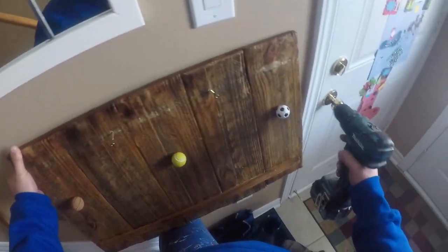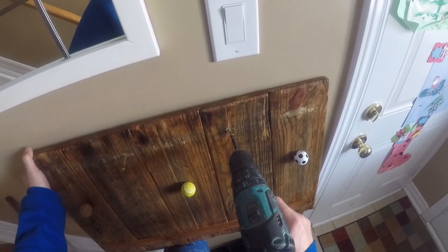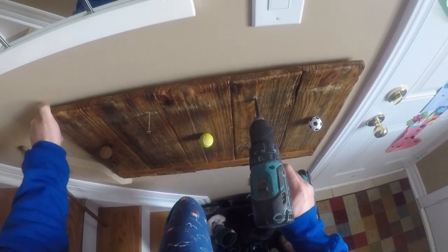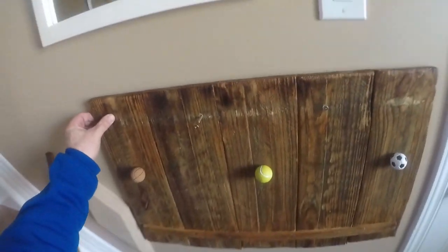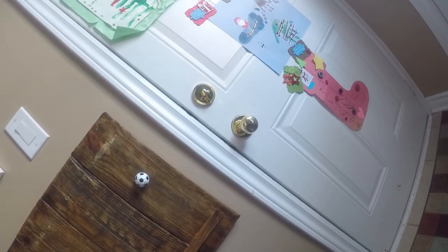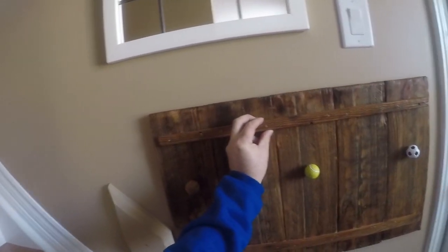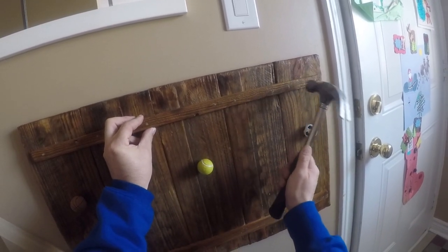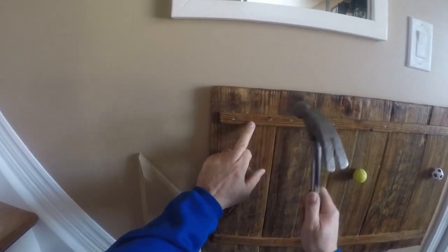Plenty of strength. It looked pretty good — I was really happy with it. My two anchor screws go right into the board, and behind is the aluminum piece, which goes right to the stud to give it maximum strength. Then I came back and installed the decorative piece that would hide the holding screw. Pretty cool. Thanks for watching.